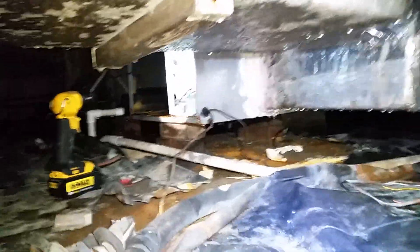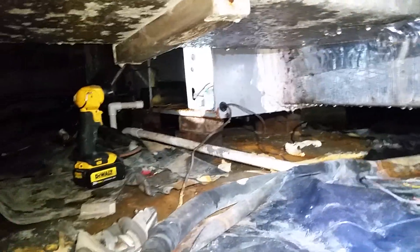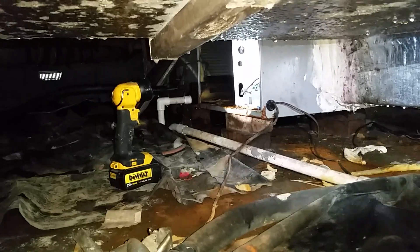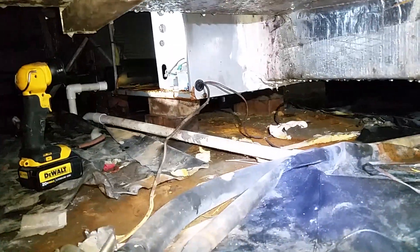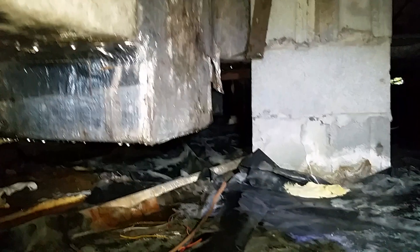Check this out - that unit's full of water. It's got the drain line with a little p-trap on it, which is all good. Hopefully you can see a little bit of slope - it comes down right here, then 90s back behind this pillar.